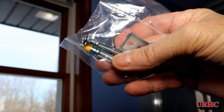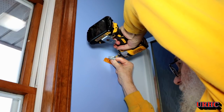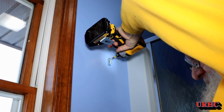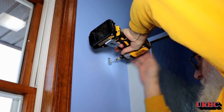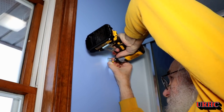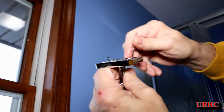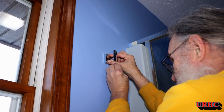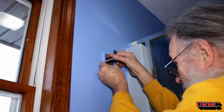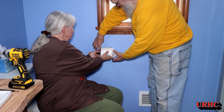That 30-inch bar is just perfect for two bath sheets without having to triple fold them — that way they stay fresher and drier. There's a wall robe hook, and again I located this one on the stud so I don't have to use anchors and I know it's really going to be mounted on there good. I used two Kreg screws — they really do hold well and have good pullout when you use the coarse ones in a two-by-four. Same backing plate and mounting as the other fixtures — you get the screw started, set it over, eyeball it level, then give that screw a final tightening.